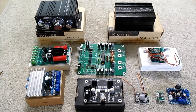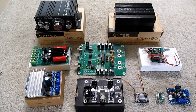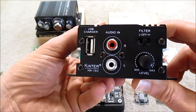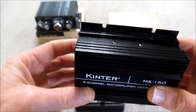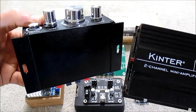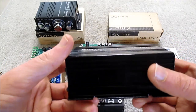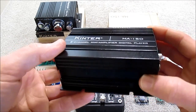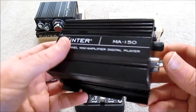Let's take a look at which ones I think are the best. The best of the Kinter amplifiers I reviewed is the MA150. The main reason is you can use it with 4-ohm loads and get better output power. The problem with the MA170 is they used a chip that can only handle 8-ohm loads if you run it at 12 volts. But the MA150 has a proper chip that can handle 4-ohm loads and give you around 12 watts per channel — that's why I gave this amplifier the win.